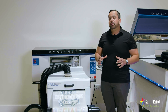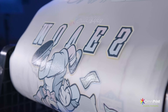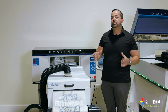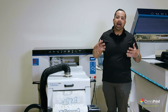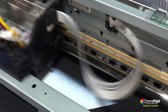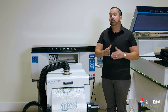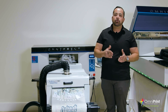One thing to note: any printer doing DTF or roll-based printing on film — you want to have a vectorized image. That means a clean, crisp image around the edges, without blurs or gradients. If your print jobs require gradients, outer glows, or more of the shirt coming through, you want to look at our line of direct-to-garment printers, because that's the only way to get those kinds of images on a shirt. You can also do DTF on those. It depends on your different needs and what equipment you get. That's why I want to highlight what kind of images you need to professionally print high-quality designs that make customers order over and over again.